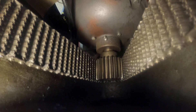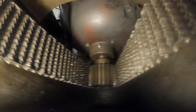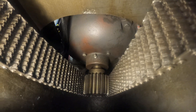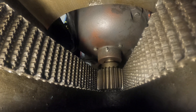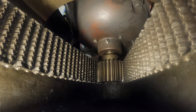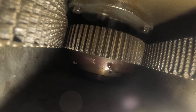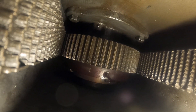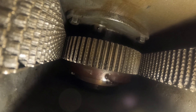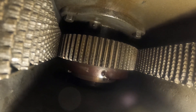What happens is the sprockets wear out on these. This machine is 80 years old. They also use this drive on the Reed Prentice lathe, and my brother has one with the chain still intact. What happened over the years is those sprockets wear out — this one down here on the motor, then the drive hub up top. So we machined the teeth off those and grafted a groove pulley on them. I actually did work like that for one of these years ago — converted that sprocket to a V-belt.